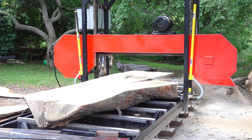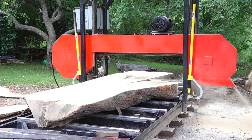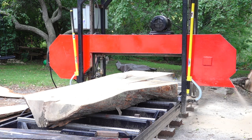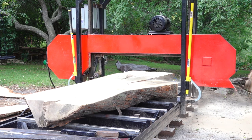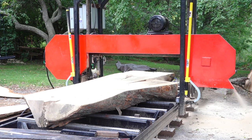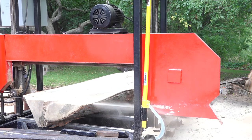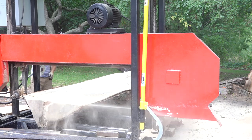This week on the sawmill I continued cutting the log that was on there a couple of weeks ago — that was the biggest log I've ever had on my mill. My friend Eric came by and we're working through cutting up some more of it. Eric wanted to experiment with drying some really thin stock, so we're cutting half-inch slabs out of this. We ended up cutting 10 of these. Eric has a vacuum kiln with a press in it, so it should be pretty easy to dry something like this.